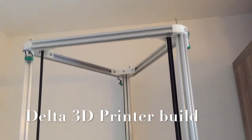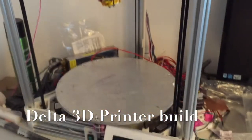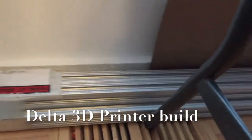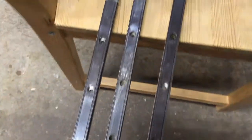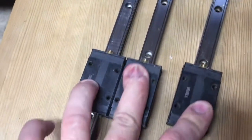It's going to be a Delta 3D printer built from scratch. The new frame will be built from a much stronger and sturdier material like one-and-a-half inch 80/20 aluminum profile. The Delta rods will be made out of hollow carbon fiber rods with an outer diameter of 8 millimeters. The linear motion will be done using precision ground linear guides and bearings. I'm still debating whether I should use stepper motors or servo motors for the drive system.